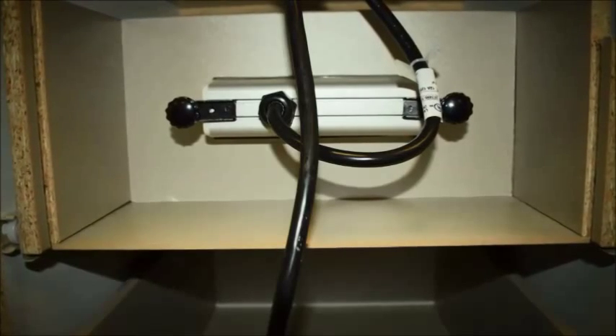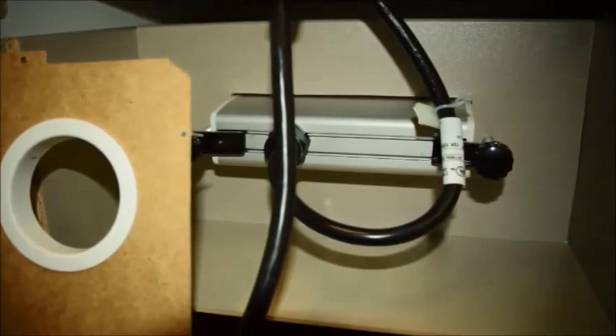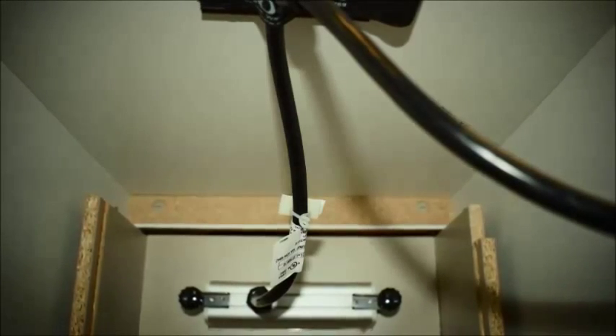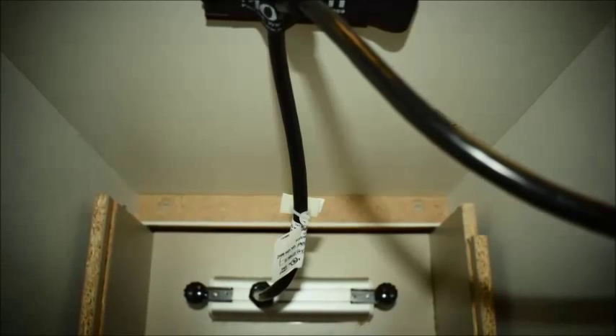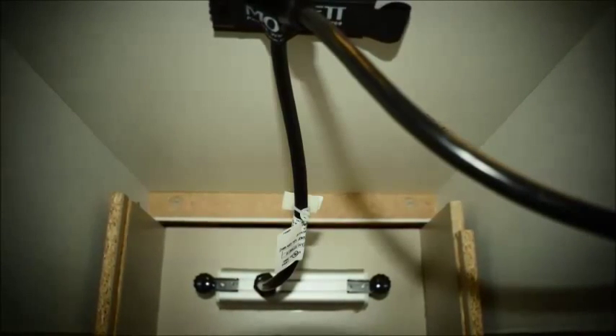After repositioning, either route out the sides to slide the rear wall into its new position, or screw into place. You'll also need to drill a hole in the back for the cable to exit, which can be fitted with a grommet liner. Allow just enough slack on the cable for the unit to move forward when the drawer is opened and then returned into the closed position.